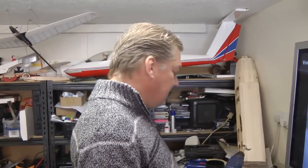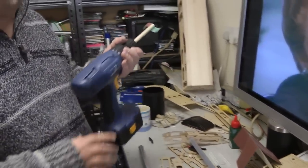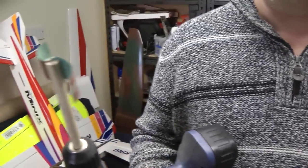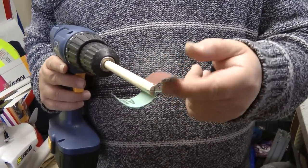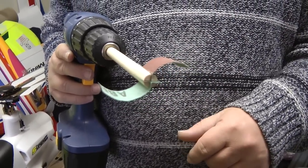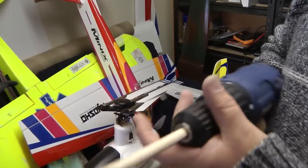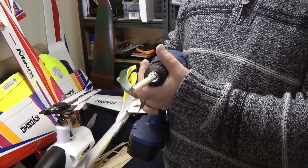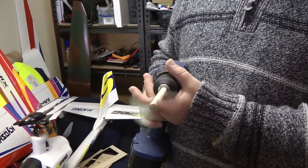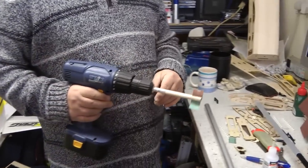Do you want to show the guys your lapping device? Yes — in case you haven't got a tool that's the right size, here's one quickly knocked up: a bit of dowel with two bits of sandpaper fitted in opposite directions, put into a cut across the end of the dowel. You can then open up your hole with this little flappy thing. If you haven't got the tool, you make it — we are modellers after all.